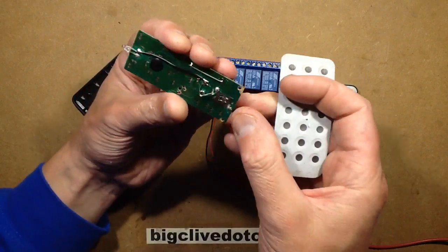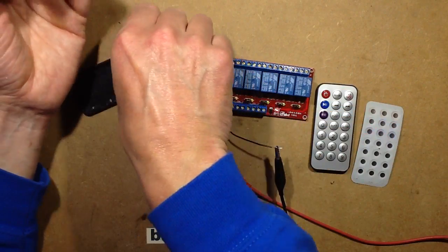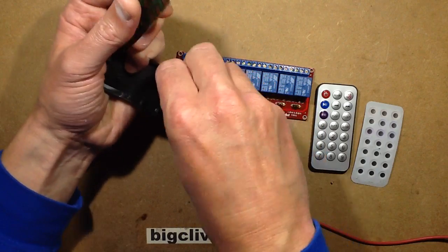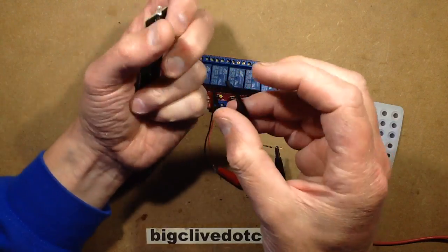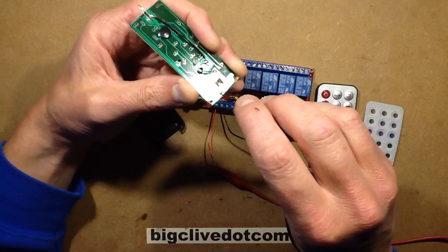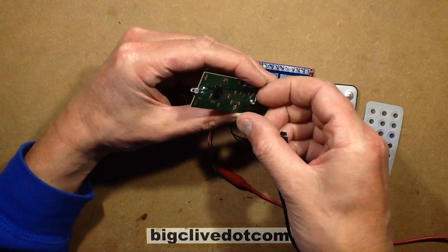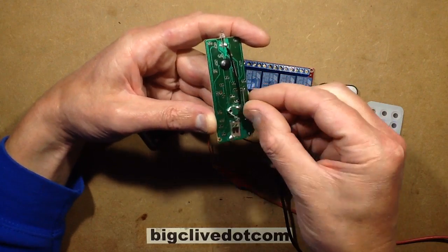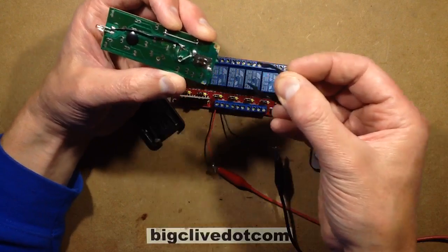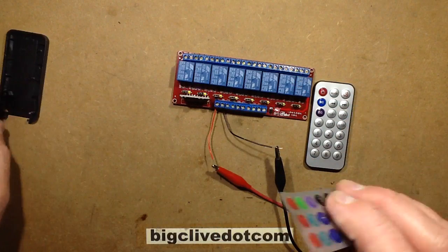The battery contact is notable. It's the little drawer that slides out. When you slide it in with a standard lithium cell in it, the negative of the lithium cell makes contact with this springy contact at the bottom. The positive just pushes against that spring there. That's how it makes the connection. It just pushes that spring back. So if you ever have problems with these, try popping the battery end out a couple of times. It can solve them. But anyway, that's dead.